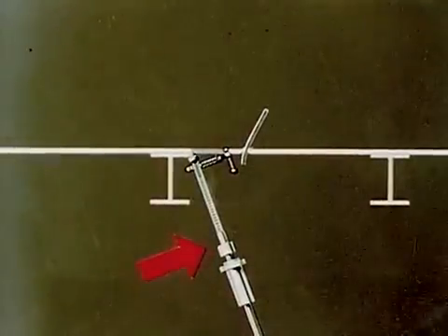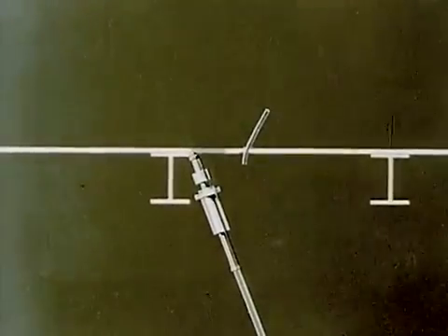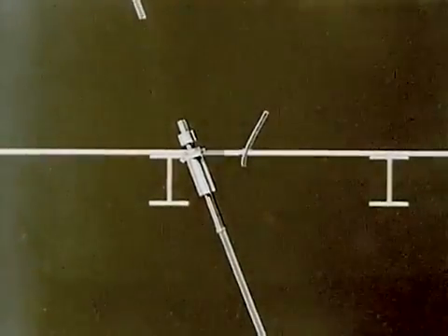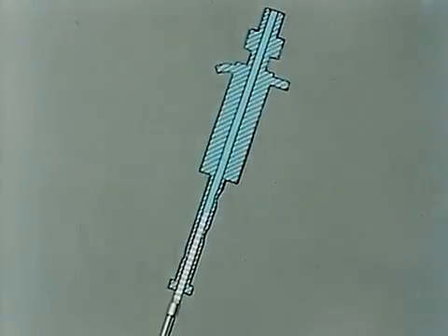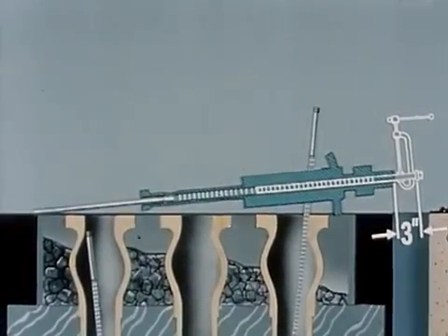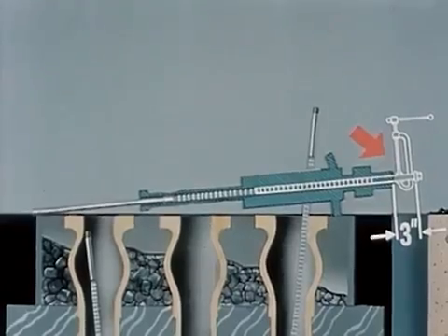The impact also broke the rack inside the plug and simultaneously caused the plug to slip back up the rod to a fully inserted position. The plug flange then hit the overhead structure and the fractured rack continued into the fan room. The plug fell back onto the vessel head, snapping the connecting rod after it had been driven upward through the plug about three inches. The scratch mark evidence and matching marks on the tube and extension explained the seeming discrepancy of finding the central shield plug with the final rod withdrawal position only three inches above the normal zero position.